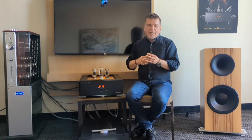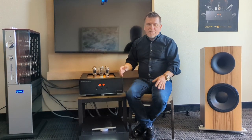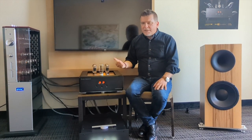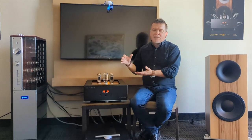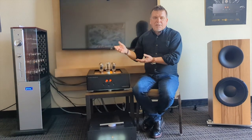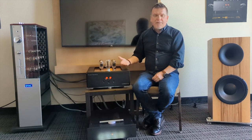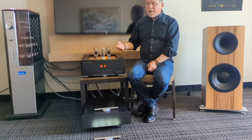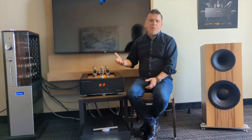So we have 4 variants, and the mix of 4 gives us many permutations. And then we don't know what plug to expect and what pinout to expect. So going without a standard is hit and miss, more or less. Many companies produce their transport and DACs to match together, but they don't care about other people because they don't encourage other manufacturers' devices to be plugged into their transport or vice versa. So we had to choose something. We have HDMI, which is just a convenient kind of cable and plug, and we have I2S in an Ethernet cable, the RJ45, which is easy to manufacture by yourself.